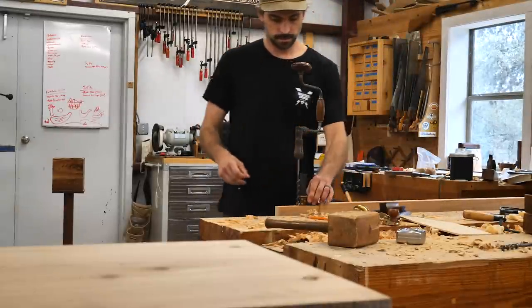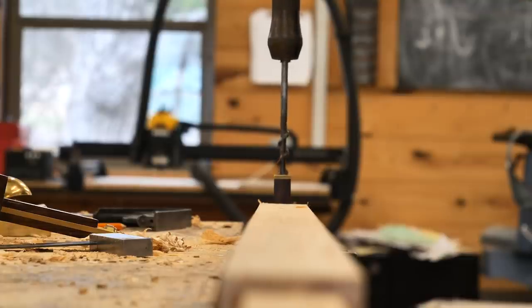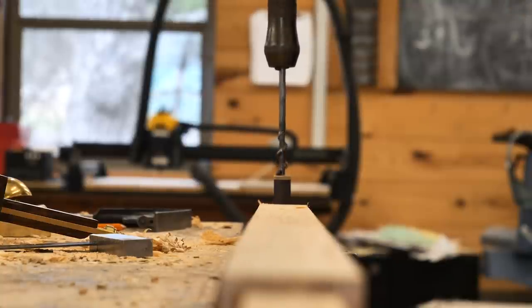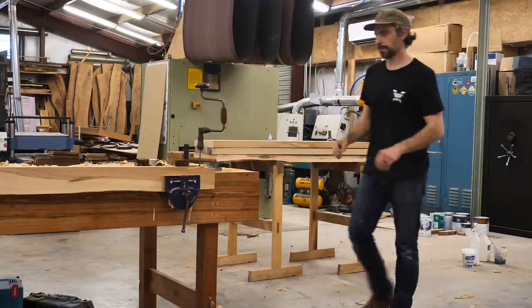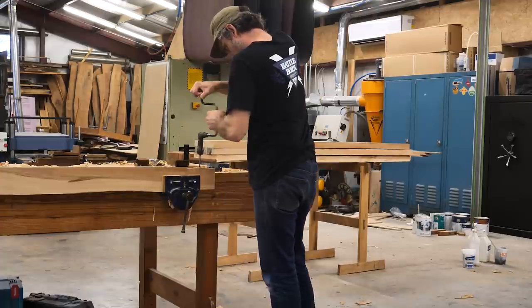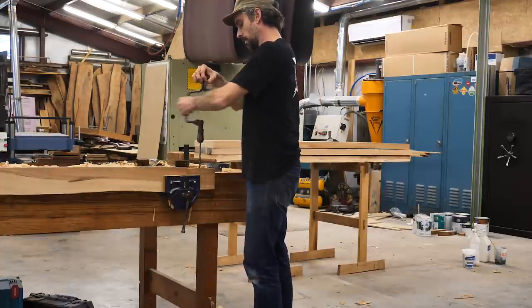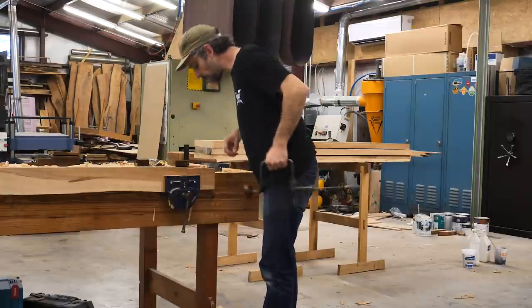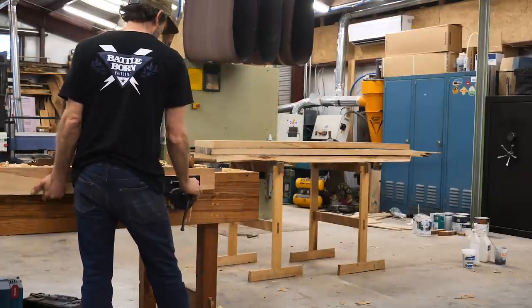So if I drift or angle this at all it basically just could ruin the work piece and become ineffective. So it is absolutely crucial that I drill this as straight as I possibly can — which again, I hate to pat myself on the back but I really did impress myself. I did a pretty dang good job. I took it slow and kept my square on it, cranked it four or five turns, got off, made sure I was staying on, eyeballed it and made sure I was staying in line. When I flip it over you'll see where that tip came through and it's almost exactly in the middle of that tenon and on the layout line that I transferred around.